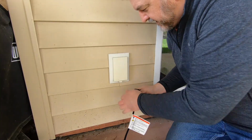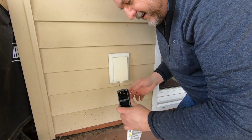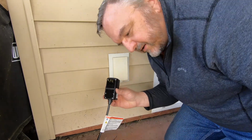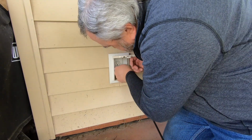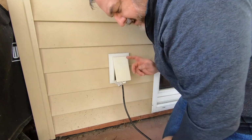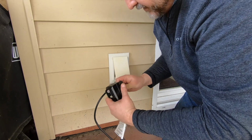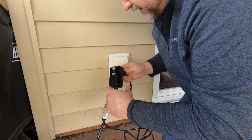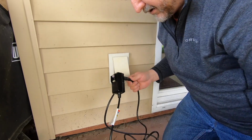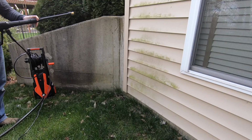In the backyard, all I've got is an outdoor electrical box. It isn't feasible to get that in there. I will say it's a double insulated unit, so that means there's no third prong on here. It's what's necessary for me to plug this unit in. It has a polarized plug, so it does have one blade wider than the other, so you have to have a polarized extension. So that's where you need a small pigtail like that just to be able to plug in the unit. Also, you'd want to keep this up off the ground in case there was any wetness. We'll get the air out.